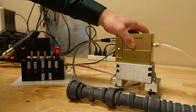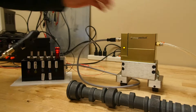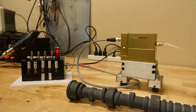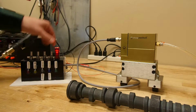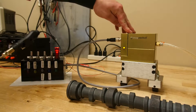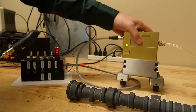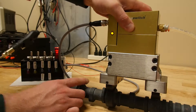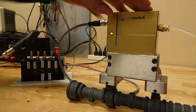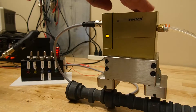This is the J50 Degauss tool and I'm going to demonstrate smart tool calibration and functionality. First I need to enter calibration mode, so I'm going to flip the calibration switch. As you can see the LED flashed three times — now you know you're in calibration mode. I'm going to put the unit on the part in what would be ideal contact and then turn the unit on.